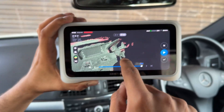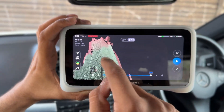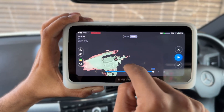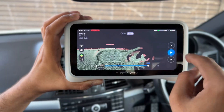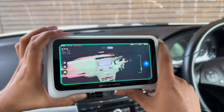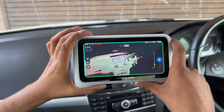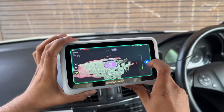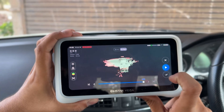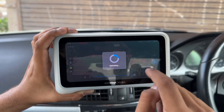I can pause the scanning process to review if anything needs to be re-scanned. Another great part about the scanner is that it has no wires attached, which makes it really easy to use — similar to holding a camera or a phone. I resumed the scan after reviewing to scan some more surface. The all-in-one Einstar Vega 3D scanner creates a mesh from the point cloud in the device itself, making it really easy to export the model directly. After scanning, I'll quickly check the scan data and then press the tick button.